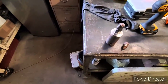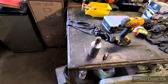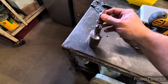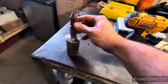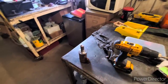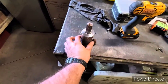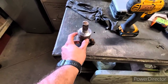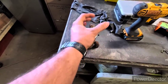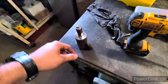Well, I was just editing my video here and realized a really important clip is missing from it, so I guess I'll reshoot it here, but 3 days after the fact. So that's less than ideal. That is the drive for the second part of the auger on the grain vac. You'll see in one of the clips here, Antoine putting it back together, but this fits down into the flighting with a couple bolts through it, and then there's a bearing and hanger that bolts to the tube, and then there's a cog that goes on here so that when it starts to turn, it locks in and turns the next set of flighting.